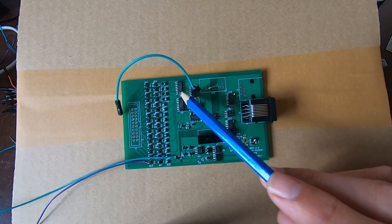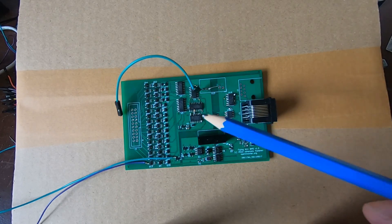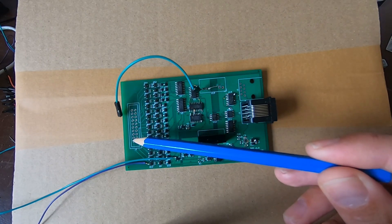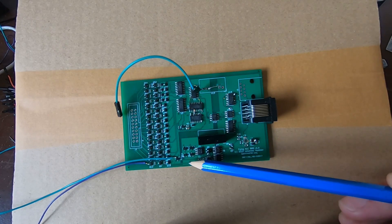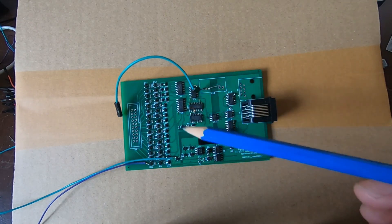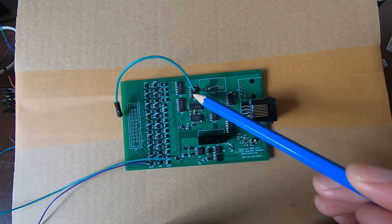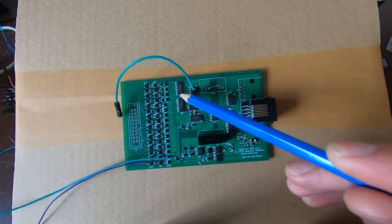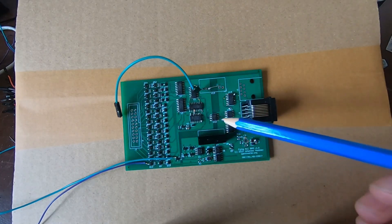The upper decoder chip is for the positive output channel, and the other is for the negative output channel — each with eight outputs. This means even cells can only connect to the negative output channel, and odd cells to the positive, or probably the other way around. There's also additional circuitry ensuring only adjacent channels can be switched on simultaneously — the two decoders see the same address signal or that signal plus one — providing another hardware lockout against faulty turn-ons.